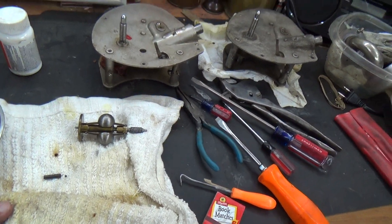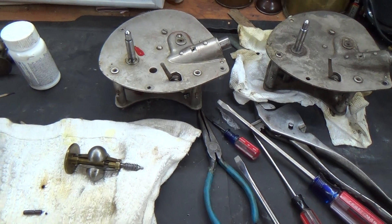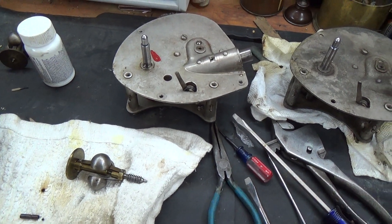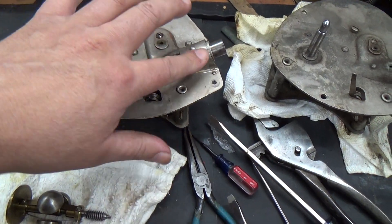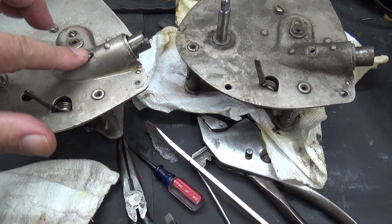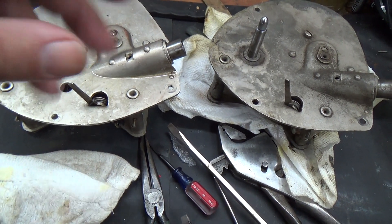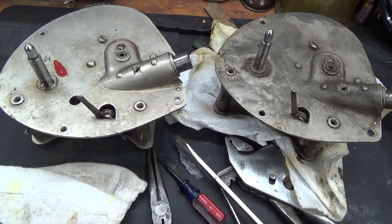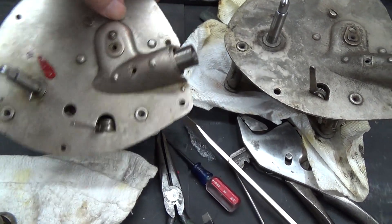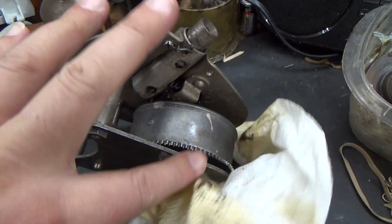The motor is done and ready to go back in the machine. I still have other things to do — swap out the handle, inspect a few other items, and work on the reproducer. The gears all look good; the spring was a little weak so I put in a brand new mainspring at the customer's request. Everything's been taken out and cleaned — including this winding handle gear assembly, which is what winds your mainspring. It usually looks like a mess, with a lot of hardened grease in there.